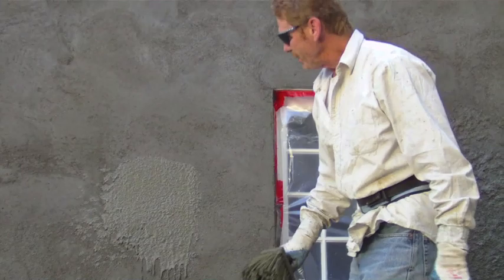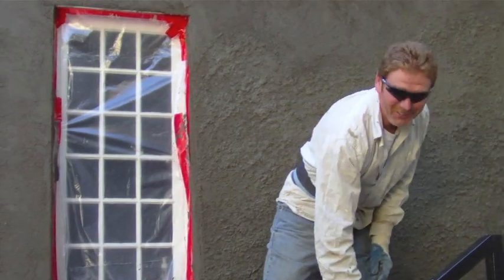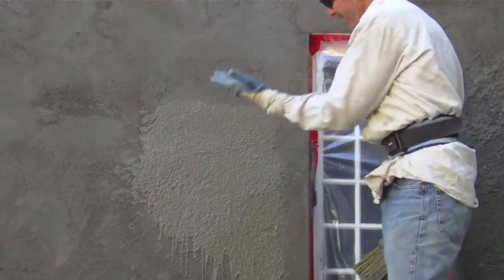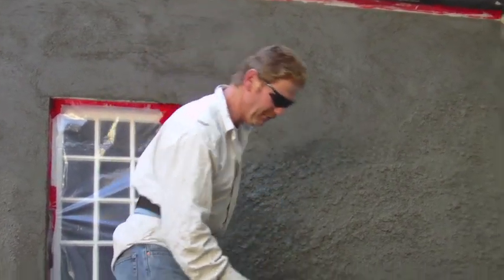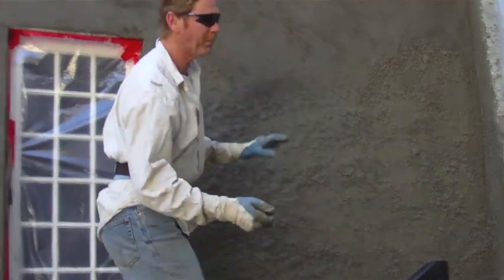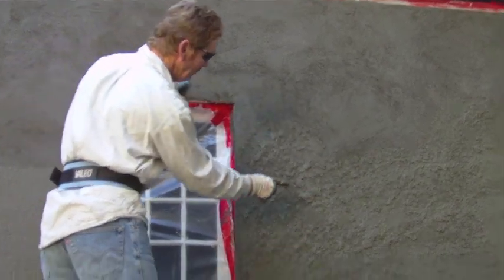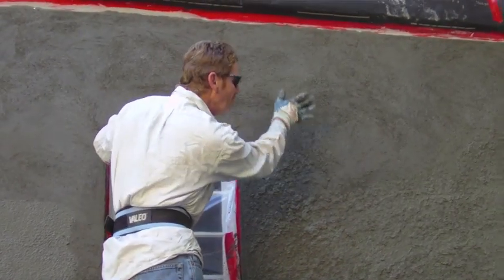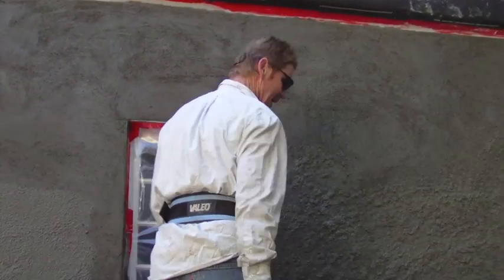You might ask why not just put it on soupy to begin with — I'll show you. Here's the soupy mix I'm going to use to match that finish. This is my second coat, but this area is not quite set yet. If you try to put it on soupy to begin with, watch — it just runs down there. See it? The rivers are falling down, but now I'm left with nothing. So after I get my base coat on, I start from the top and give it the second dash finish. It's much waterier. After the base coat — the heavier, dryer aggregate — I come with my follow-up and it'll start to drag and fall down just like over here.